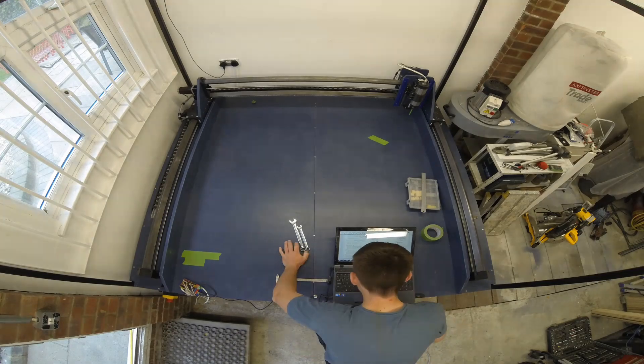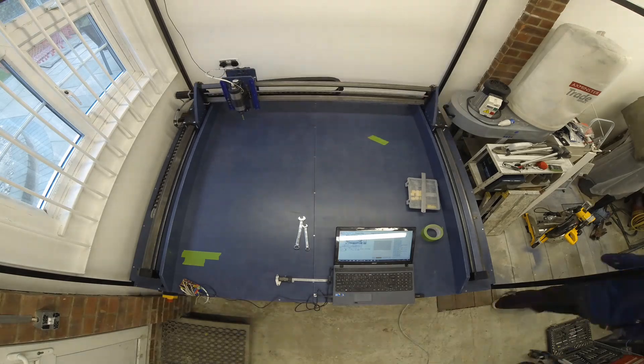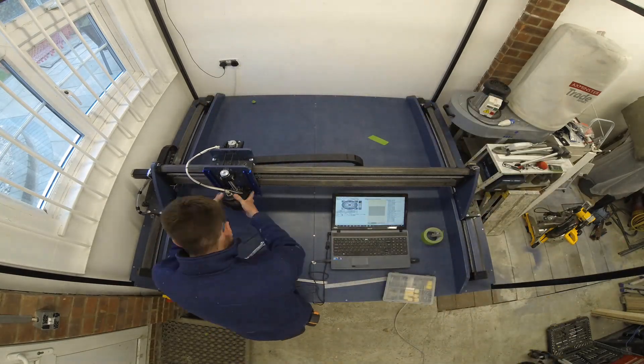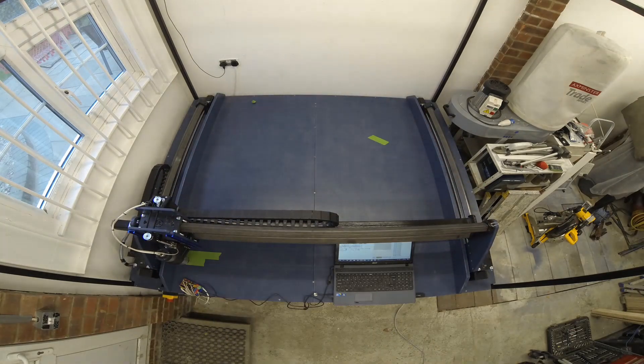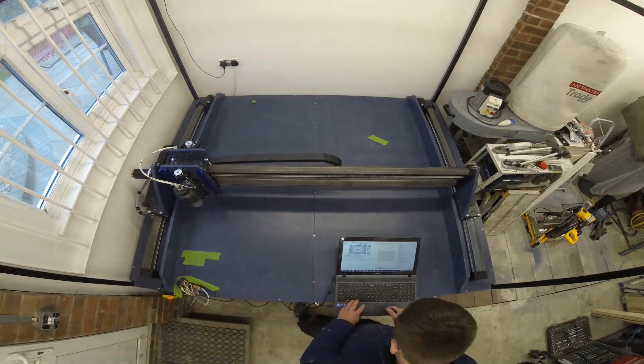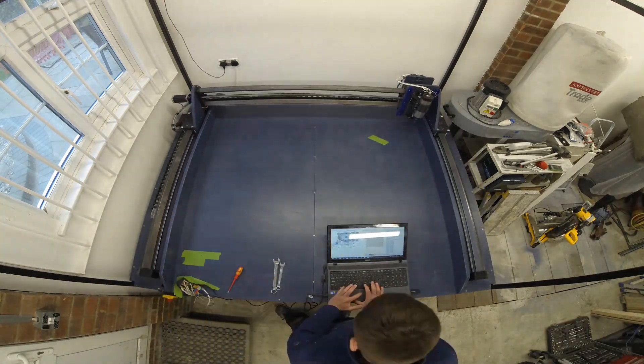What I'm doing now is getting the machine to drill mounting points for workpiece holding. The workpiece holding uses some M6 insert nuts. I did get the wiring backwards the first time and it was drilling holes in reverse — it didn't stop, it just made a lot of smoke. Swapping two wires around resolved the issue and I was back off to the races.